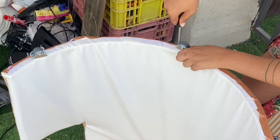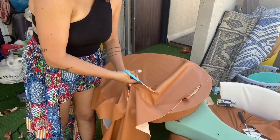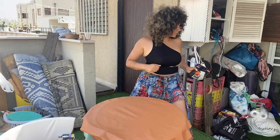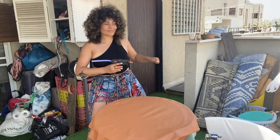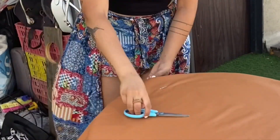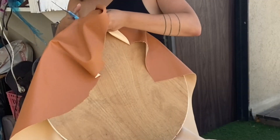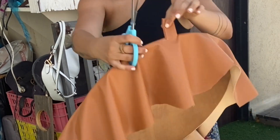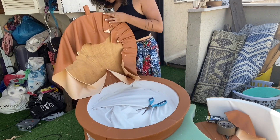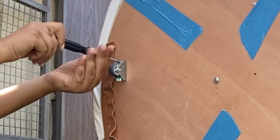Time to add your wheels. I'm going to screw only one screw inside each so that it stays movable — even if you want to pull the chair not just back and forth but also left and right, it will still be able to do so. I put four wheels on the makeup section and four on the sitting area. Now we cover the makeup section — make a little hole on the bottom, wait for the hot glue gun to heat up, add glue on top of the wood, make a hole to pass through the metallic handle structure, then pull it to the opposite direction on the inside. Pass your little handle thingy through, then use your staple gun to close everything — it'll be hidden by the mirror so the staple is stronger and more resistant.